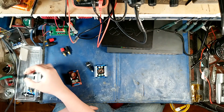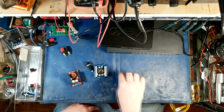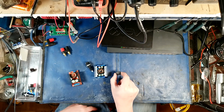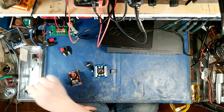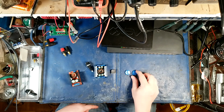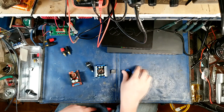And you're going to want a full bridge rectifier in this as well, because this will help protect your equipment from getting reverse polarity damaged. That's another very, very important part. And if you really want to get fancy, you can throw some MOVs in there for good measure. They'll act as surge suppressors to protect from any electrical surges coming in through the power input.